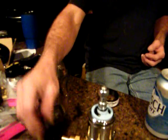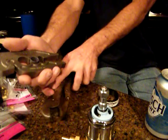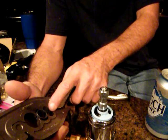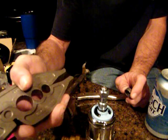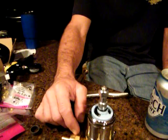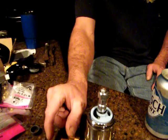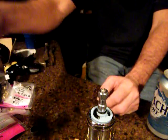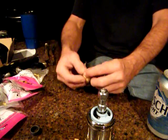Your pipe will go on, the ring will go on, and then this will fit right inside like that. You take these pliers and you squeeze them down until you can't get a piece of paper in between — it's just gonna be mashed flat. I'll put the tape on here and here, get it built, and then I'll be ready to put a short little piece of PEX here and a short little piece of PEX here, then put the elbows.